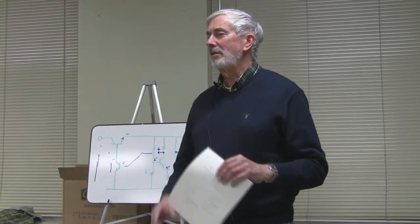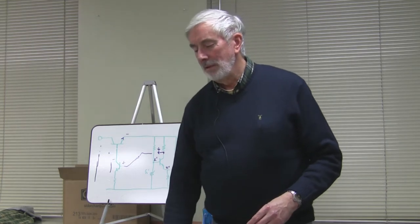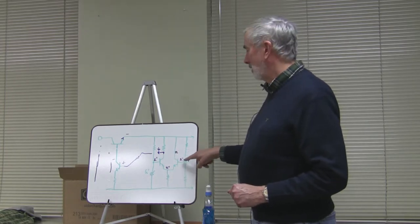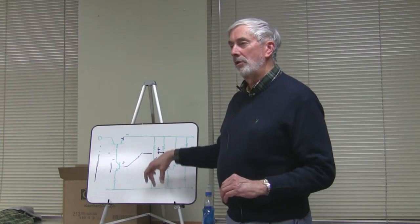The 7812, or the 7800 series of regulators, are made with a huge number of differential amplifiers — that's why I started out with differential amplifiers. It measures the error and amplifies it through multiple differential amplifier stages internally in the IC. The other key piece of information on the differential amplifier is that the current stays the same. The voltage doesn't actually go up — just the current goes up — but the voltage here stays the same, so the current through the resistor stays the same. The differential pair current stays constant, and that's what makes this circuit work with the 7805.